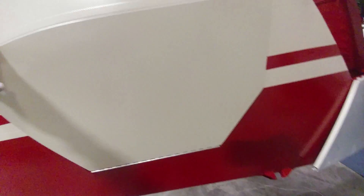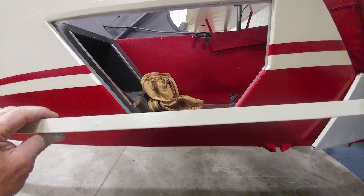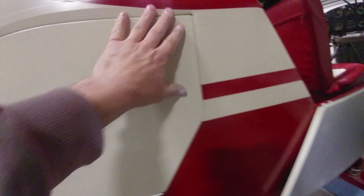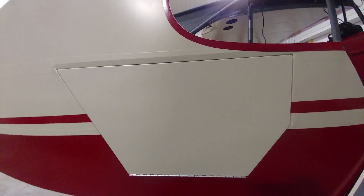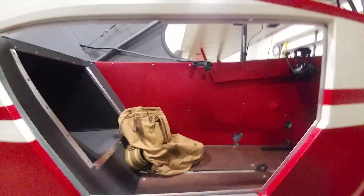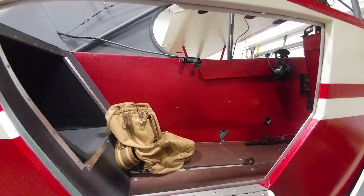The door is a custom-made door that I built. It's a built-up wood door with aircraft plywood on both sides and then covered with fabric so we get the same texture as the outside. I also set it in flush so it trims out really nicely. It needs a stripe yet — that's why I'm fitting the door today — so I can prepare to put the red stripe on and paint the inside red to match the leather on the interior aluminum panels.